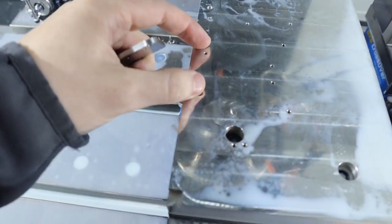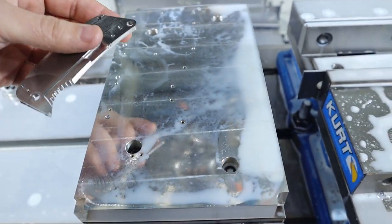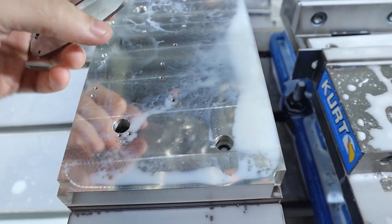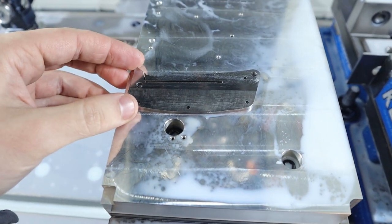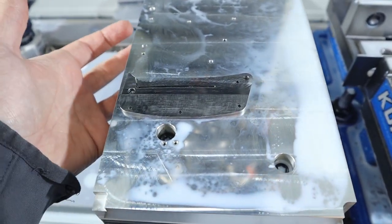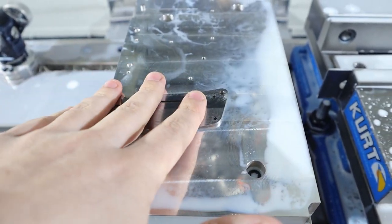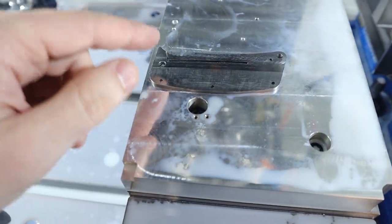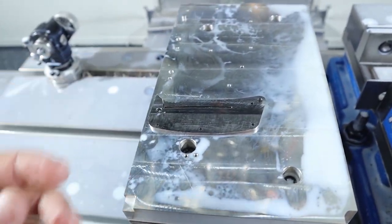I ended up putting some dowel pin holes here. So what we're going to do is take this and, how does this go? I think it goes this way. Line up the dowel pin hole, and then in those holes on the backside we'll stick 2-56 screws and secure this thing nice and flat, no protruding hardware. We'll only use the dowel pin to locate it, then we'll pull the pin because we need to cut a bore in there. And let's set it up.